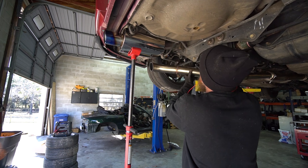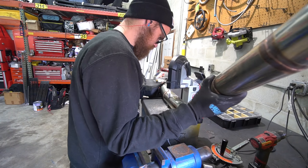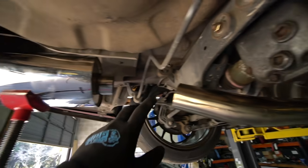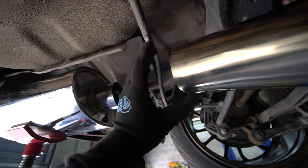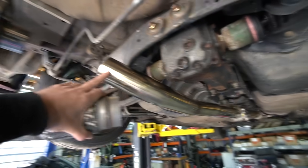I might have to cut here and then pull in a short mid or something. I want to kind of try to get this piece up in there and get a better idea before I cut more, because where the muffler needs to go ends up right in the bend of the 45. I think we'll cut it here in the middle and then try to bridge back to it. We've got our muffler positioned and we've just got to figure out if we can easily get from here to here, or if we need to go even further. The first thing I'm going to do is go ahead and put this flex joint in right here — it's a good spot, right past this V-band, and it'll give us a lot of flexibility down here.